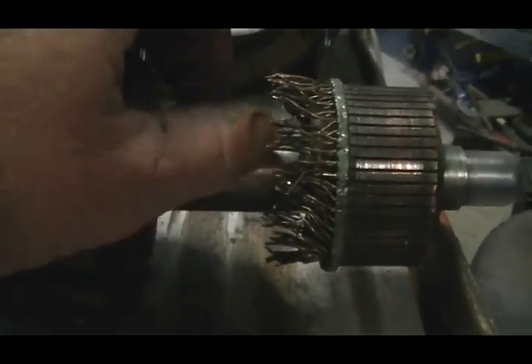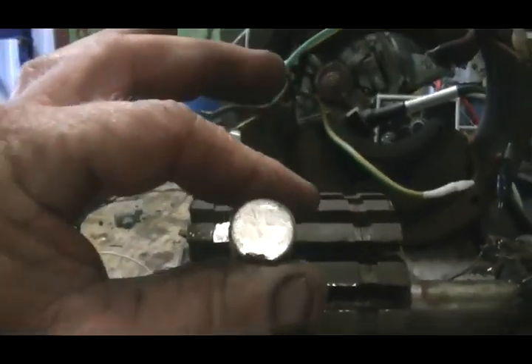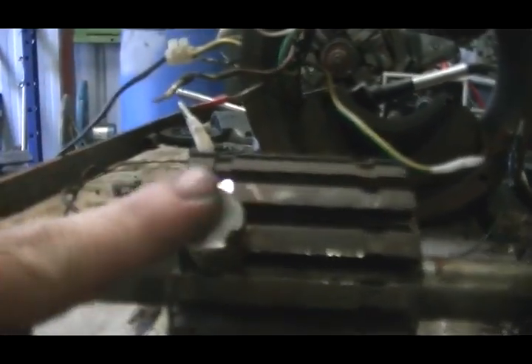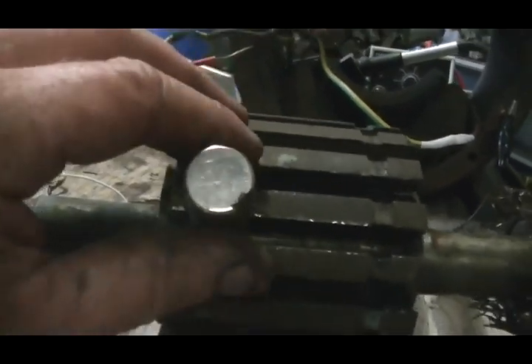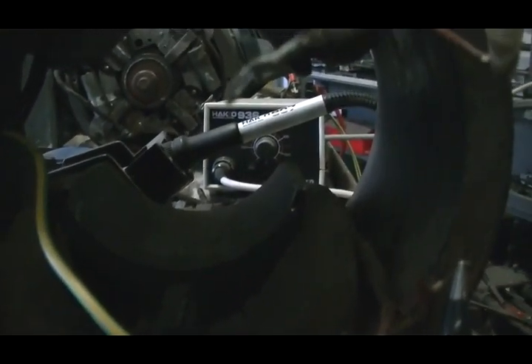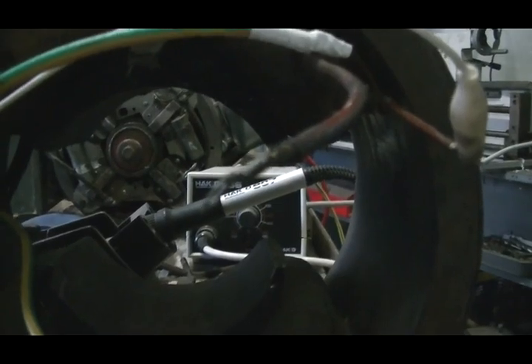That's all ready to go. We're going to be cutting out one of these segments and filling it up with very strong neodymium magnets — three to four in each segment. South on one side, 180 degrees on the other side they'll be all north out. That means we're also going to have to flip the poles of the magnetic fields within the core four times every revolution.